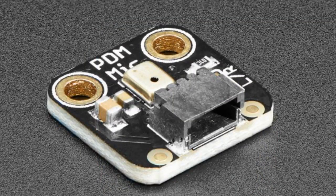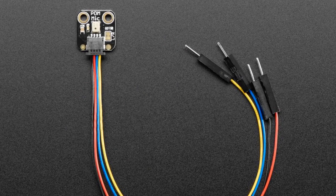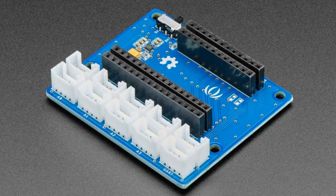This is not an I2C board but it has a data and clock pin, so that made it convenient. So if you want a PDM microphone that you can easily attach to a cable, this is it. We have PDM support code for CircuitPython and Arduino M0 and M4, but not all chips support PDM — like you definitely can't do it on a 328 — so just make sure your chip can support PDM input before you pick up this mic and wire it up.